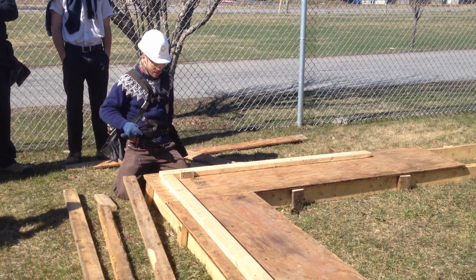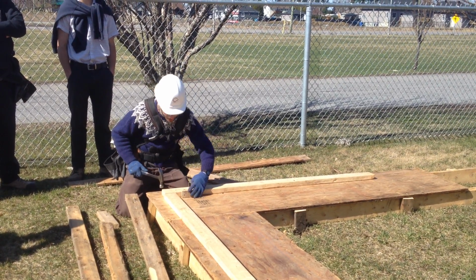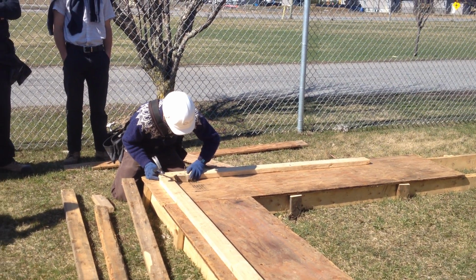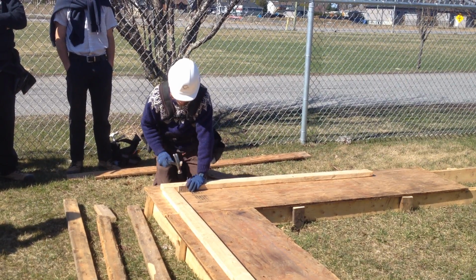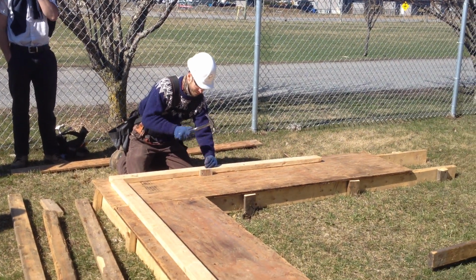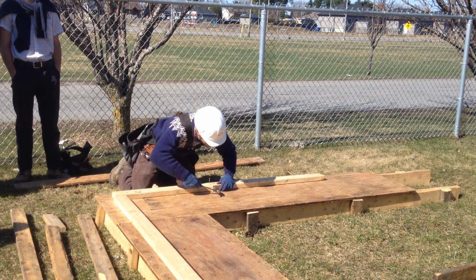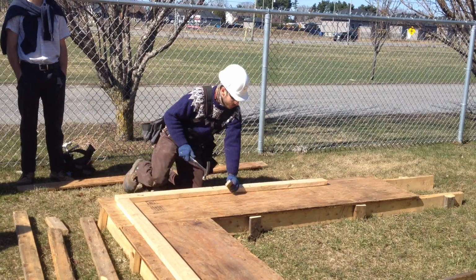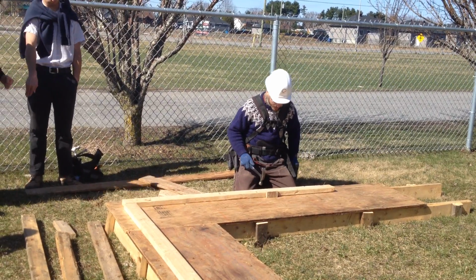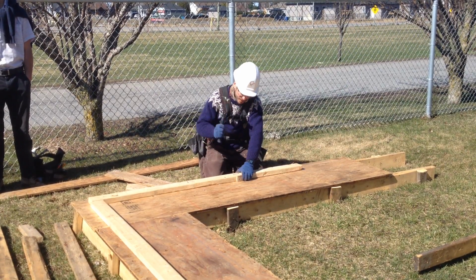Like all the time we nail, you start nailing, you prepare your nail, then you place your piece of wood about where it's going to go. You lay out the distance, your thickness of plywood, and then you can go. You have to take your time doing this procedure, because some of the material is warped, right? Some of the 2x4 are warped. So if you just nail and expect it to be straight, it'll play tricks on you. It's your time to correct it.